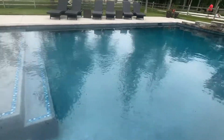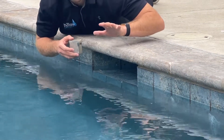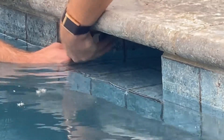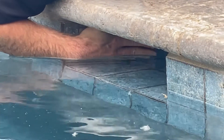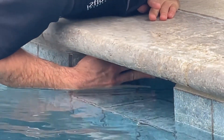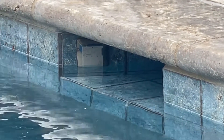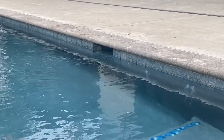You don't have to move too fast on this — it's more about making sure it's mixed well so it gets a good stick to the side of the skimmer. We're going to put it on the entryway to the skimmer. The set level we want should sit about a half inch to an inch up on the sensor, so make sure you install it in the right area. You just press down, kind of wiggle it into place, give it some really good pressure. I've got about a half inch into the water here. Sometimes you might want to hold it for up to a minute to really make sure it's sticking — in this case it felt good so I left it pretty quickly.